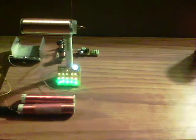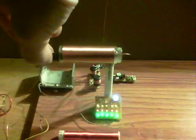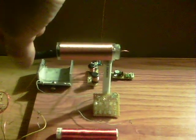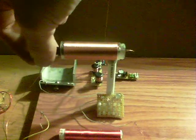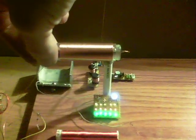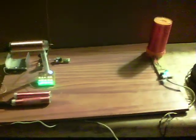We're on 1.5 volts here, and this has all been about the tuning today. I've got the ferrite rod on the inside. If I move this ferrite rod, you can see that it goes out of tune. You can let go and try to bring it back — bring it back into the strongest again. I'm very pleased indeed with this.